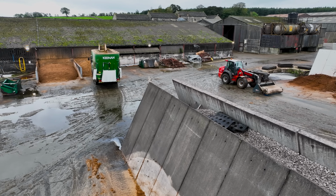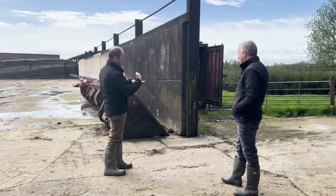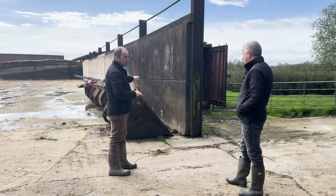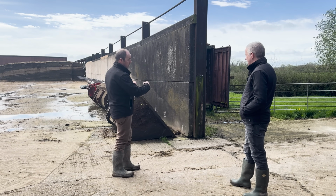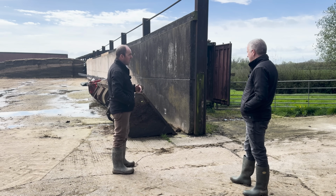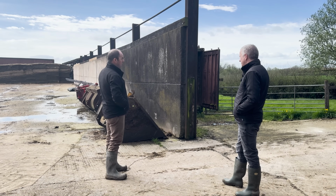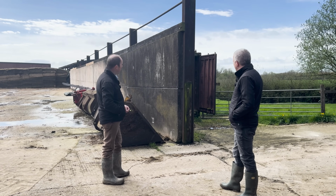And the last option we have is basically a T-shaped panel, or an A panel, which is an inverted T. So it's cast concrete at the bottom and then with an upstand that sits on a base of dry mix concrete, and then you pour your floor up to it. It's tied, rebars tied into the floor slab. They're a bit more common, quite a quick construction once you've got your footing laid, quite quick to lay in place. They make a corner panel, they make an internal wall, and it makes it quite quick and robust.